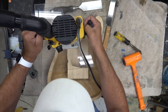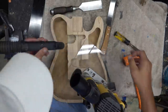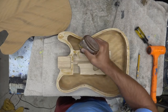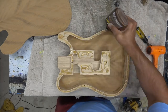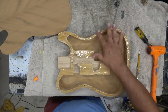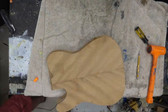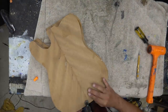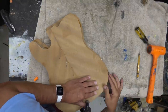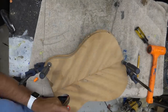I'm totally reconfiguring this guitar. Ben is going to send me some humbuckers to try out. Then we're going to run some hide glue on the top — I had previously cut out the plate to sort of fit it. Sometimes I prefer using my finger over a spreader because I can gauge exactly how thick it is. Here I'm lining up that seam so it's perfect, then we'll start adding more clamps.